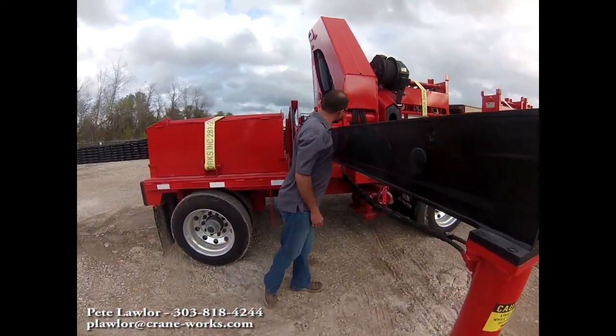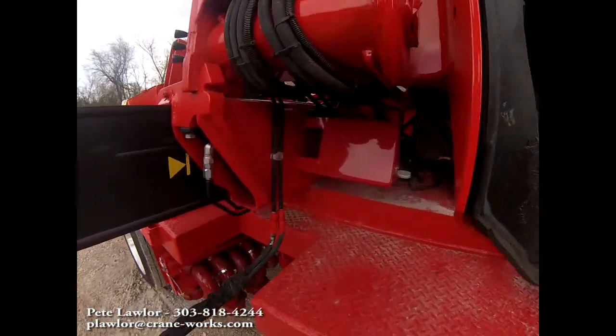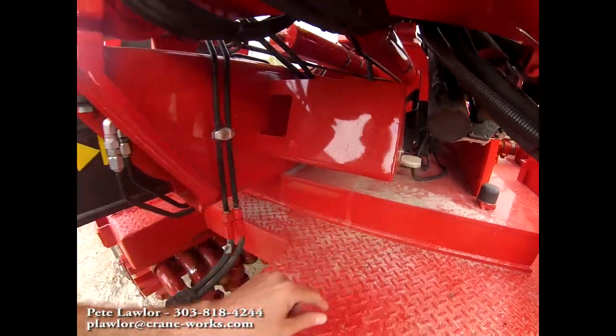We're going to extend our passenger side rear outrigger. This pad is useful for loamy soil, mud, asphalt, or concrete — if there's a water line or anything underneath, this foot could punch through the concrete. The outrigger mat just kind of spreads the weight out. What I'm trying to do is get this unit level from front to back and side to side. We've got a level bubble right up underneath here, and it looks like we're pretty close to level.